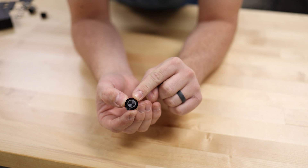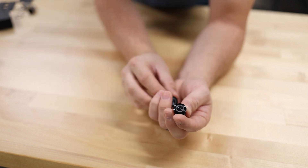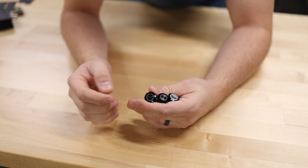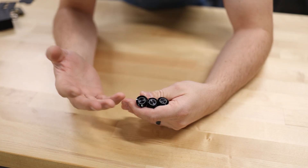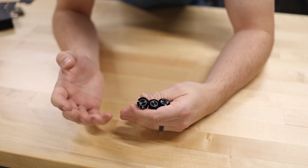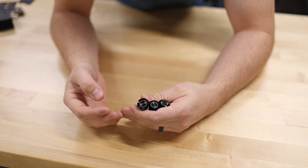Here are the design requirements. He wanted to use little push buttons with an RGB illuminated LED — one button for breakfast, one for lunch, and one for dinner — reminding him to feed his dog at 7am, 1pm, and 6pm. At feeding time the light turns blue. If he hasn't fed the dog within 15 minutes, the light turns red. Once he feeds the dog and pushes the button, it turns green, telling him and his family the dog has been fed. Additionally, this needs his wife's approval, so I need to design a minimal, nice-looking case that sits on the kitchen counter without looking distracting.